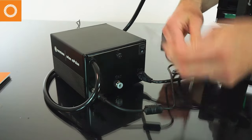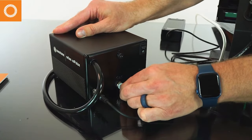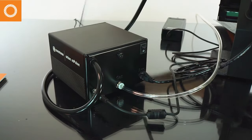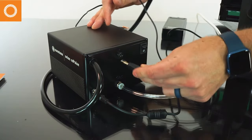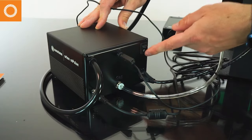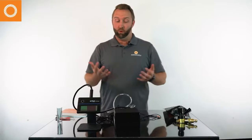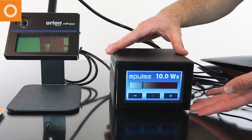For your argon gas tubing, that's going to go in the bottom — be sure to press it in all the way and then give it a tug to make sure it doesn't come out. Finally, for your alligator clip, that's a banana clip that just plugs right in. With everything plugged in you're ready to weld — hit the power switch and the welder is set up and ready to go.